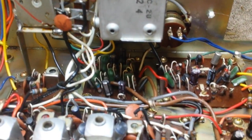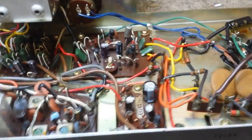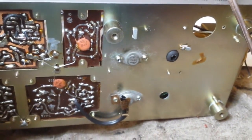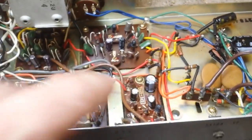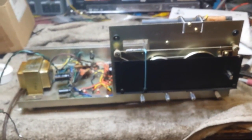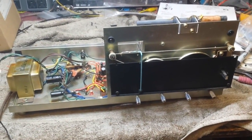Down underneath the tuner there is an active tone control and preamp section. You've got a no-kidding driver board which fires into a set of TO66-type output transistors, so probably good for a couple watts at least. It's got a regulated power supply, although primitive. It's a pretty well-built thing — all-metal chassis — you can see the power transformer there is sizable for a radio.